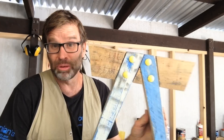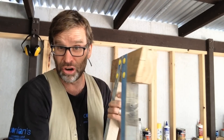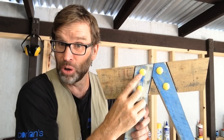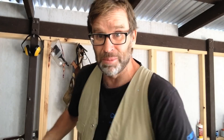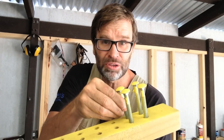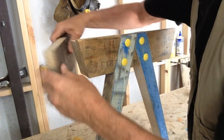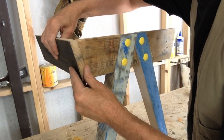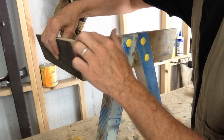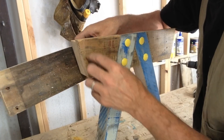Here's the side of the table all done, and I think it looks pretty good. Now all we need to do is attach the front and then nail down the top. You may have noticed how I've painted these bolts yellow — I'm going through a bit of a yellow craze at the moment. A really easy and mess-free way of painting all those bolts at the one time is to drill some holes into a piece of wood, place in the bolts, and then give them all a bit of a spray. It works like a charm. To attach the front to the side of the table, just simply position it so that it's nice and flush on the side and flush on the top. You'll notice how I've cut an angle on the top and the bottom of this front board, which matches that angle there.